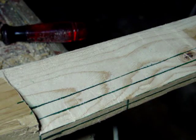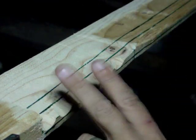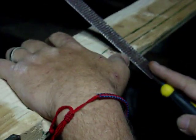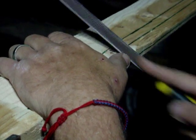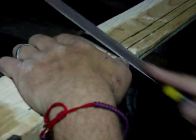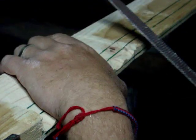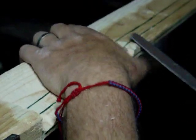What I've been doing is taking this first edge off. I've already done this — this is the second side anyway. Take the rounded side of the file, put your thumb up against it, drag it backwards once or twice and then it really bites in pretty quick going through some hardwood there. What I want to do is leave the green line itself on both sides — that way I have a standard of consistency. I'll do the same fix — let me get into some bad wood over here.